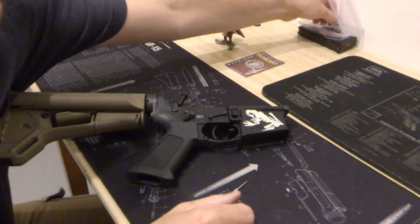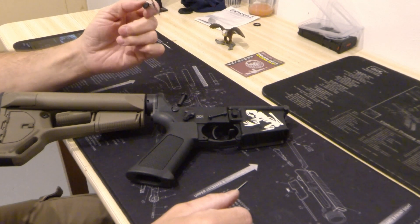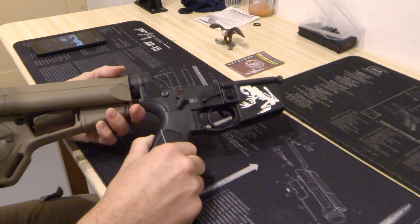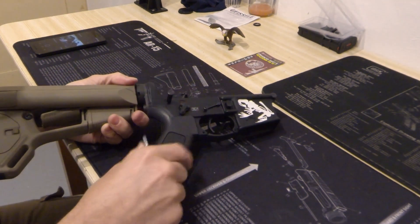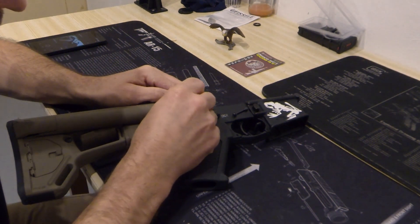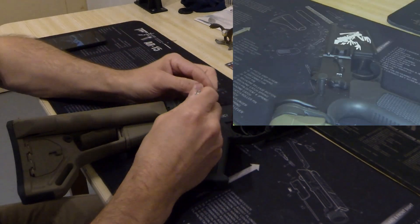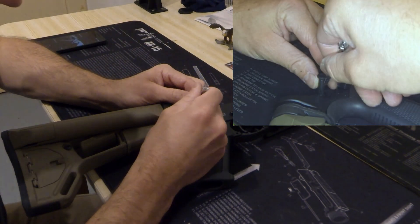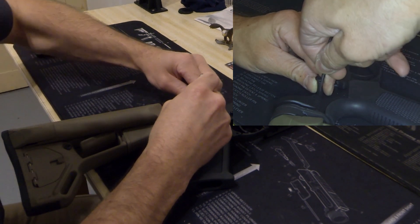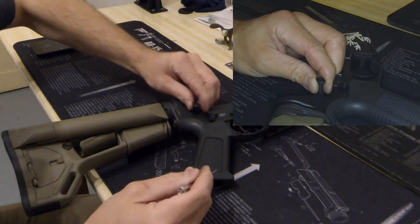But you could also use your second takedown pin or whatever you want to replace it with. So first you pop out the old takedown pin — you take the little screwdriver, go in, push it a little bit back, then it snaps over the index position. Then you just use the little screwdriver to push it in and rotate your takedown pin.